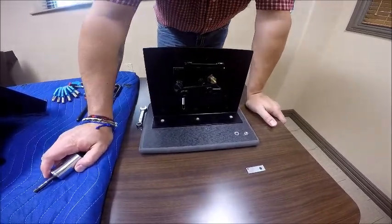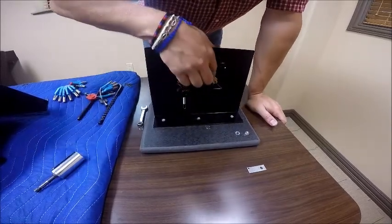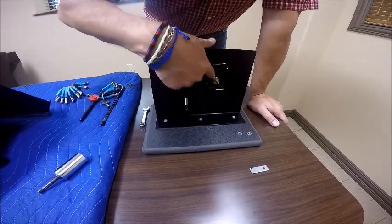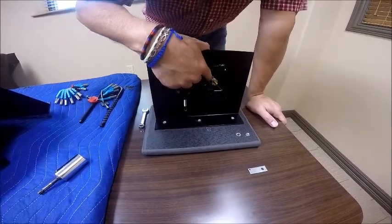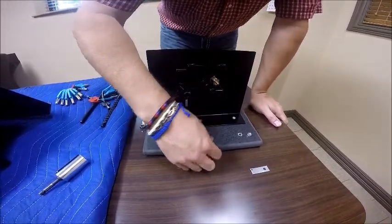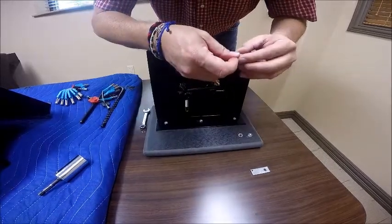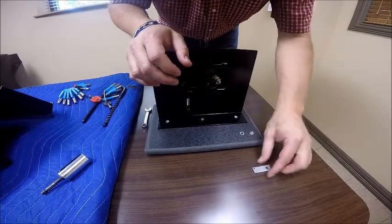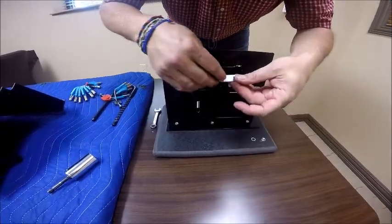As a technician in the field, we also ask that before the insertion of this lock that you put a little bit of Loctite on it to make sure that this always maintains its correct orientation of the face. Remembering the correct orientation of the stop washer, we place that over the cam stud. Then we must put the cam back in.